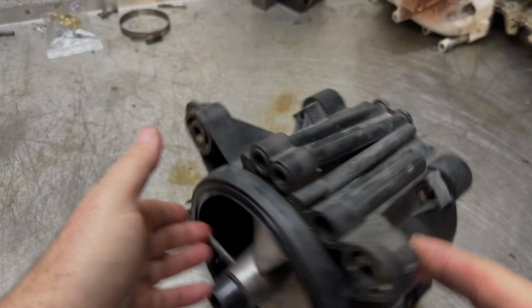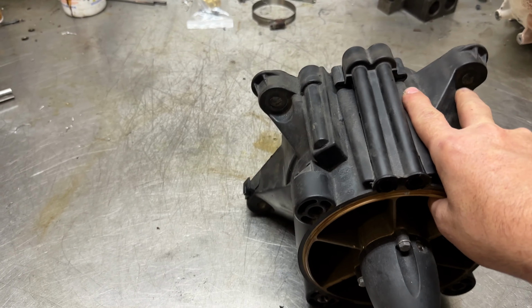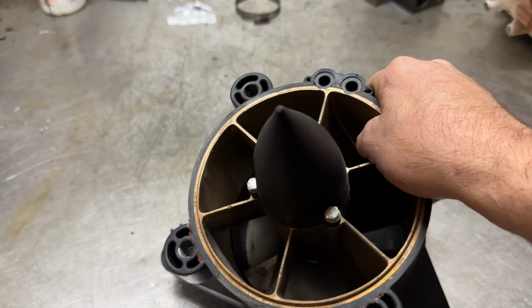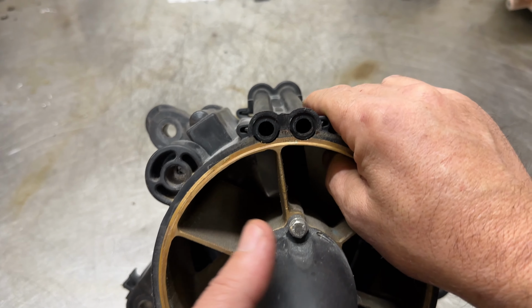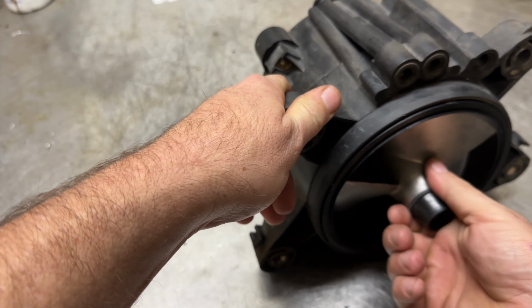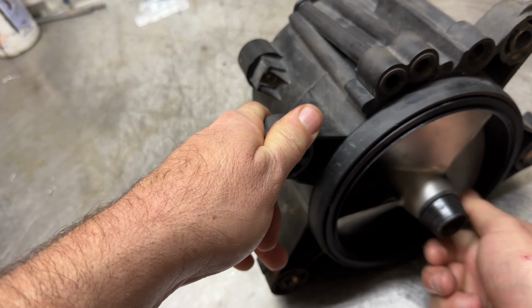Got a couple pumps in today, so I figured I'd make another little video. Show you how I do these. I gotta clean up the impeller edges, and then pump oil and a wear ring. Doesn't look horrible, but I'm gonna redo it.